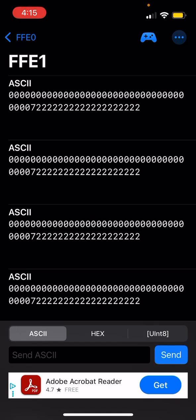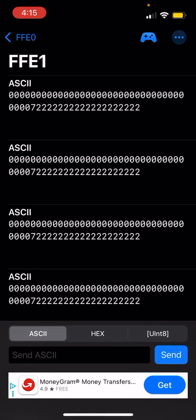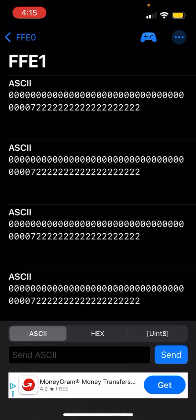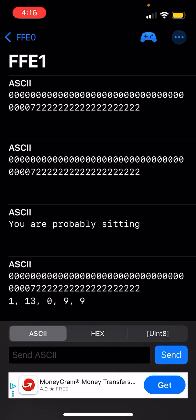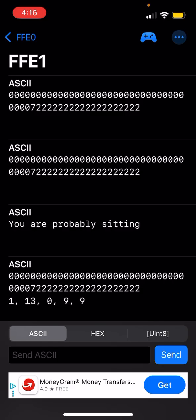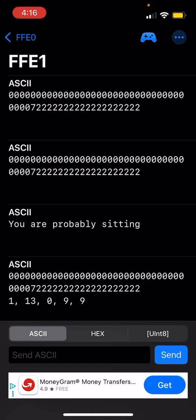So each input is sampled over 10 milliseconds, and a frame would consist of 60 milliseconds for reading every single MPU 6050. It takes 30 of these, which would take around 3 seconds, and puts them into a single input, and that creates a classification. Then it's updated every second, so it's a rolling stream of input, and the classification happens every second, but the neural network happens in serial, so it has to run really fast, otherwise it'll delay the handling of inputs.